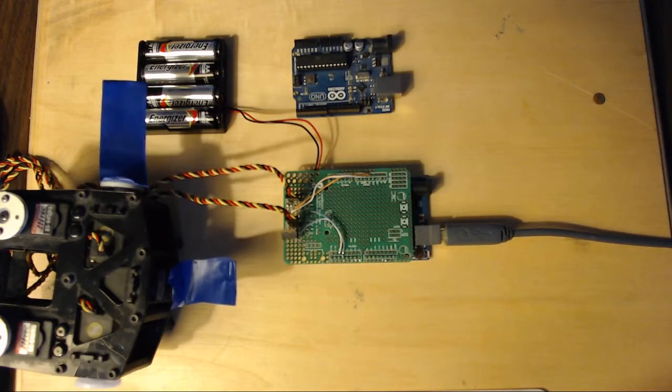So you're feeding it into the sweepers. Right. So down right here now, we have the increment of how often to update, right? This is the minimum placement and this is the maximum placement for sweeper one. And make sure that's right. Is the 15 how often, or is the 15 how much to move? It's the interval. The 15 and the 25 are the interval that comes in. And the interval is set to the update interval, right? And then down here, if milliseconds minus the last update is greater than the update interval, it's time to update.